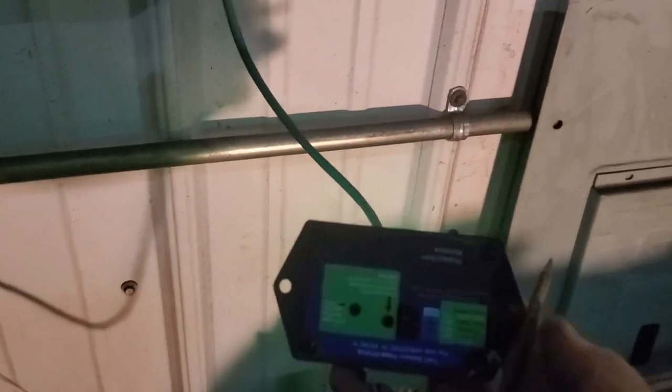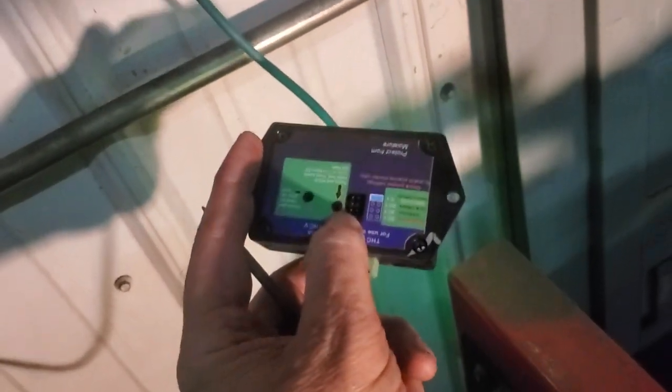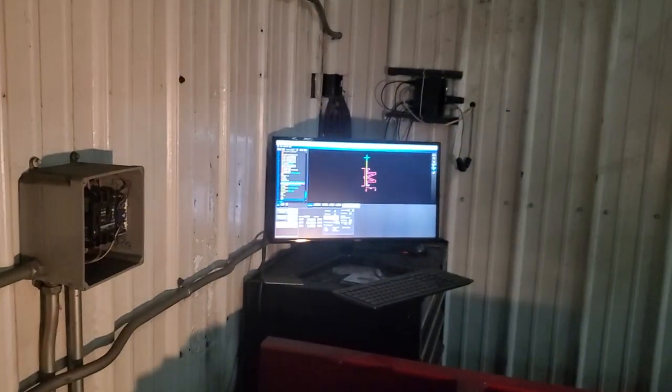And what you do is you come to the PWM, and on the back of the PWM there's a couple of test ports, and I don't know if I can do this well and show it at the same time. I'm going to have to switch hands, I think. The screen over there, when I take this sharp pointy thing and poke in this hole, there's a button on the inside of there, and it pushes the test button, and it will make 120 volts appear on the screen over there. It's just a test mode.